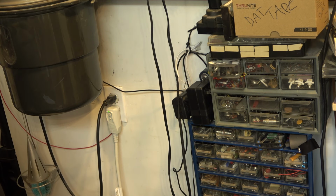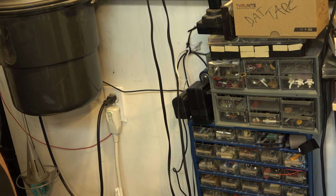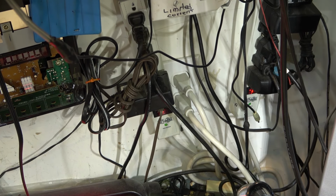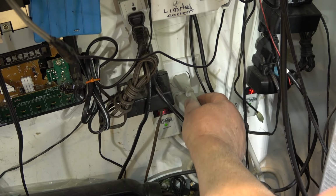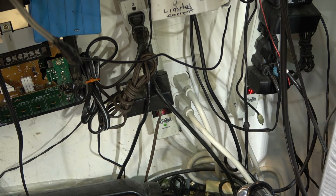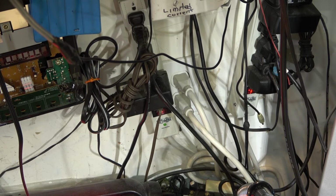There's four outlets in the garage that are wired this way, plus three more that are on their own circuit with the lights. Over here on the workbench, I have two power bars. One is powering things like my monitor and stuff, but not my bench power. My bench power is on the top outlet, which has my amplifier and this power bar here, which is my bench power. If I unplug this, you'll see that the light will go out. So my bench power is on one breaker, which is the same breaker that the central vac is on, and the same breaker that my heat gun is on. I always use the top side for my heat gun or a portable heater. The bottom side now has my other equipment. It has my monitor and scope and stuff on it.